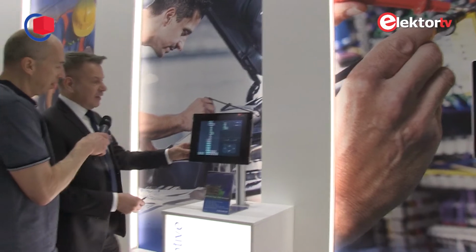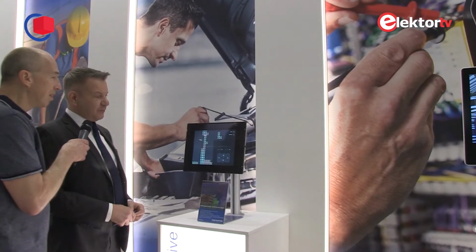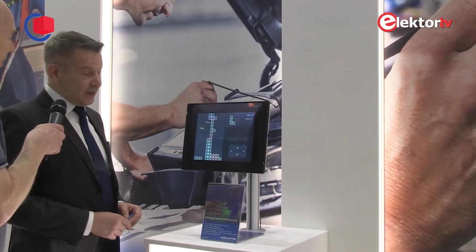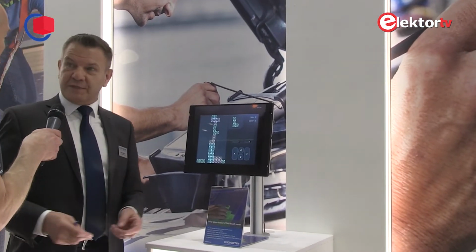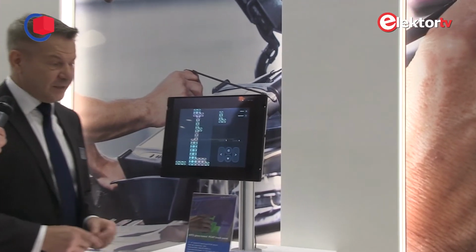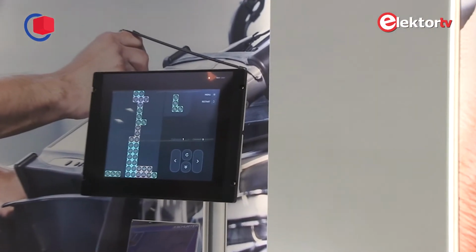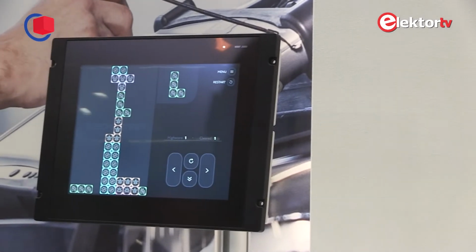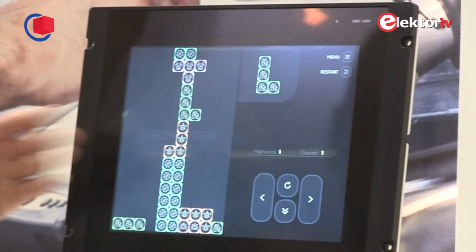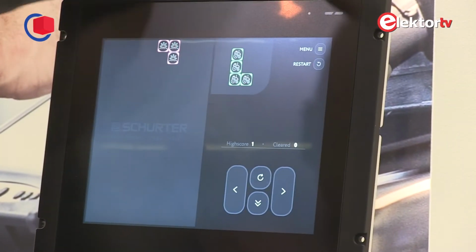This is, as I know, the worldwide first PCAP for locomotive control. Because a locomotive has a very high requirement for EMC, because the energy in a locomotive, the disturbance is really high. So you have to test maybe around 100 volt per meter. Okay. And it's the CL2 norm standard we have to fulfill. And with this PCAP panel we fulfill this norm.